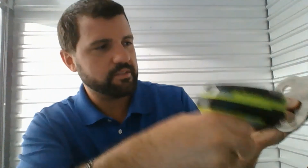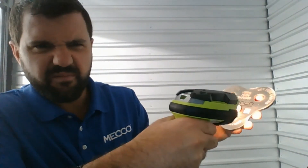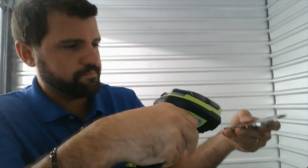The other nice part on the back end with these scanners and our setup is that after you've marked your parts and made that 2D barcode, it can also be scanned down the road with the same scanner. As you can see on the screen, it really nicely picks up that 2D barcode. So you can use the information that comes in on your parts to feed the next station. You can use travelers or computer generated barcodes to input the data into the smart box — there are multiple ways you can do it. You can use the same scanner throughout the shop, which is nice, especially with the newer smart boxes with USB applicability.